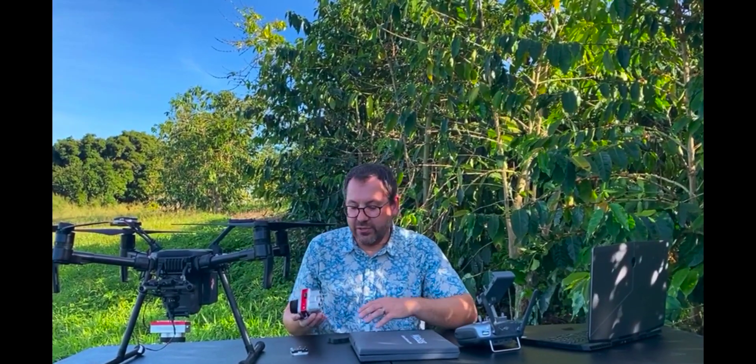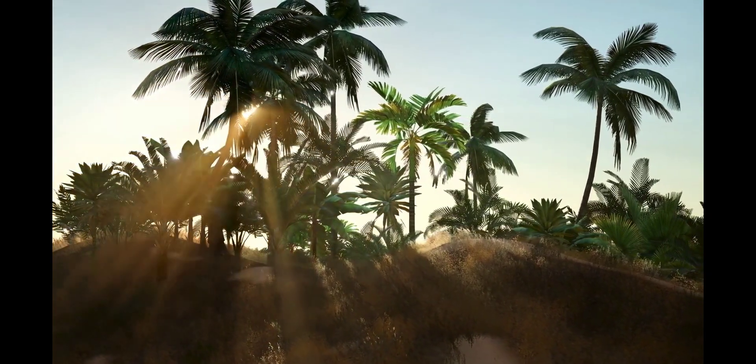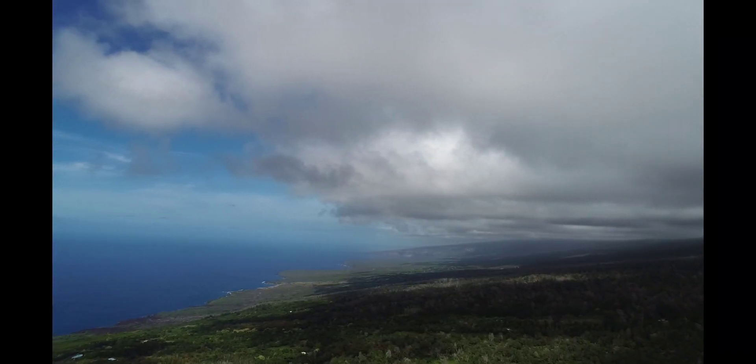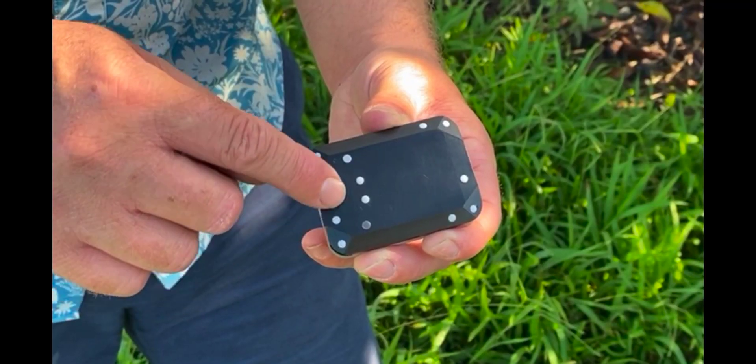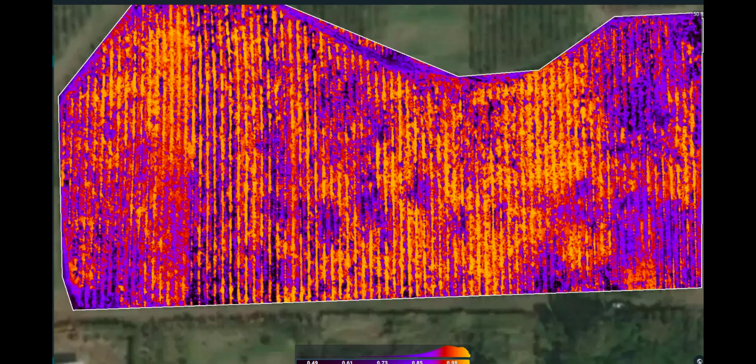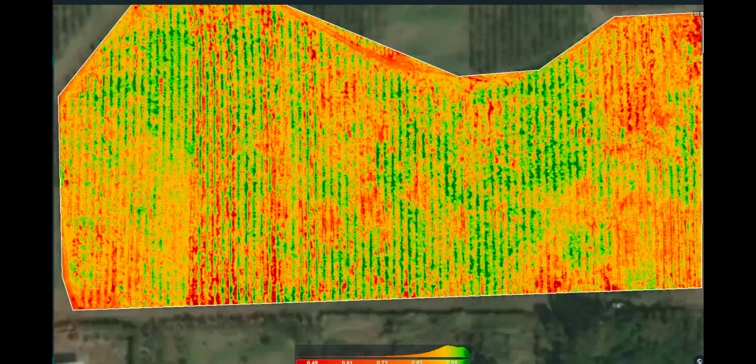It's also useful to account for the variability in lighting conditions here on the island. Right now I'm waiting for shadows — the equatorial sun early in the morning is low, and the shadows are overcasting my plants. Lighting also changes throughout the day: early on it's sunny with no clouds, but around lunchtime clouds start rolling in and cast shadows on the map. You might also have a sunny day versus a cloudy day back to back. So we use the DLS2 — a sensor that comes with both the RedEdge and the Altum — which has light diodes that calibrate the imagery by capturing how much light is coming from the sun during the flight. That way I can calibrate my maps to be radiometrically accurate, meaning the correct amount of light is reflected off my plants, and I can compare coffee to coffee across different days.